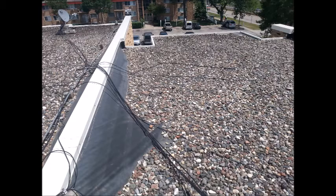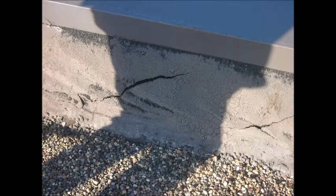How about your built-up roof flashings? Are they complete? Are they cracked from the sun or worn and damaged from the winter? Look on the corners and look for wear.